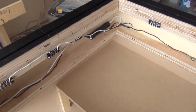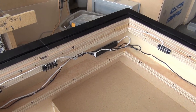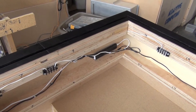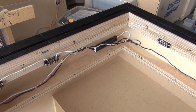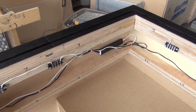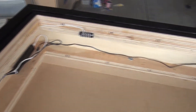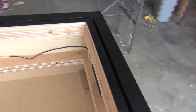We're starting to install some of our power here. You can see the LED cubes are powered through the controller boards by these USB hubs. The controller boards are actually Arduino-based. The Arduino has a 5-volt regulator on board, so we provide it with input USB power via the USB port through these USB hubs. They're all connected — there are three of them in the cube, which provides us plenty of ports.